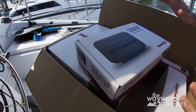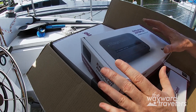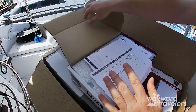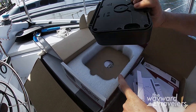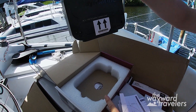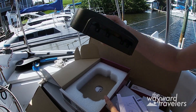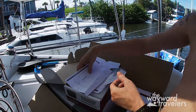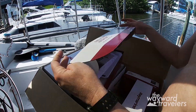The Evolution autopilot has a number of different pieces. The most central unit is the autopilot control unit, and this is the brains of the entire system. This needs to be mounted somewhere vertically, and somewhere pretty dry. We'll figure out a place to mount this down underneath.